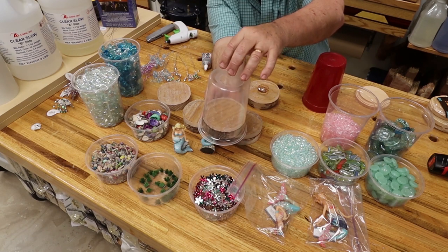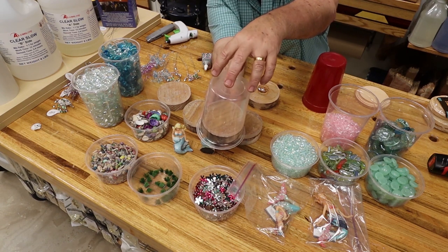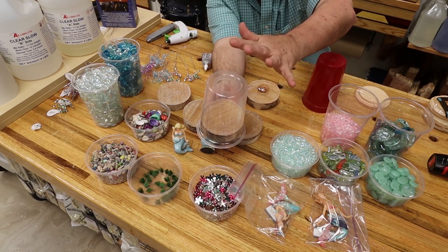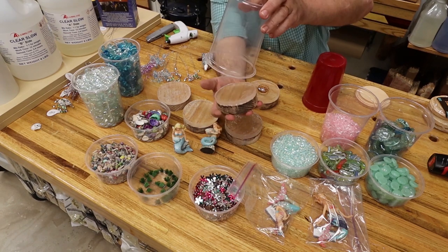If you're gonna hit this with a heat gun, if you were there for a while, it'll melt the plastic. So put a funnel above it, so you can direct the heat coming out of the bottom of the funnel, and it will get most of the bubbles out for you. Ideally, you want a pressure pot.